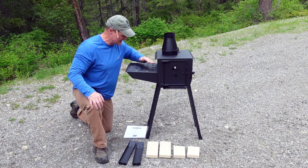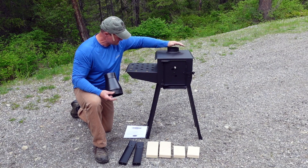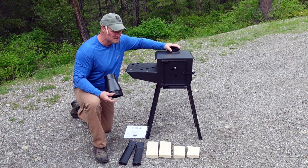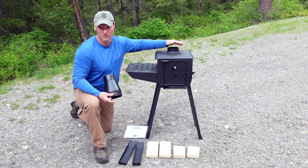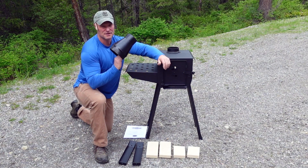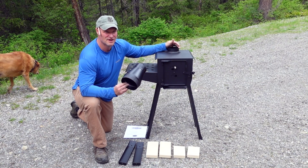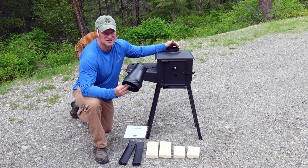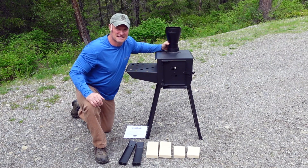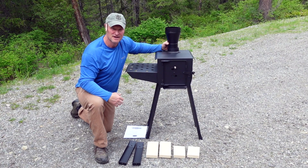This stove is just a lot heavier duty than the Camp Chef, which also has a side shelf. Another accessory is a collar that mounts with self-tapping metal screws right into the stovetop - before the collar there was just a hole, so that's obviously a good upgrade. Finally, I got an increaser - the stove outlet is four inches, but you always want to run six-inch exhaust stovepipe out of a cabin, so the increaser takes me from four to six inches. I'll also be using a spark arrestor later.